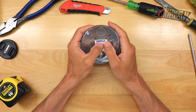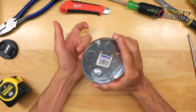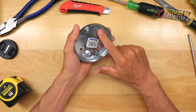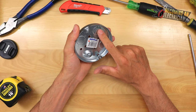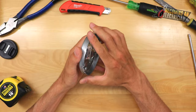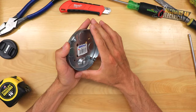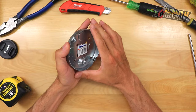The last box is a pancake box. You're only allowed one wire in a pancake box — for example a 14-3 for a smoke detector — plus one splice if you're putting a light in. If it's on the very top floor ceiling, you'll need to put poly around it for the vapor barrier.